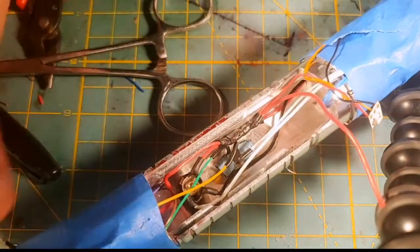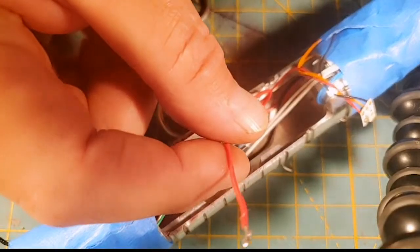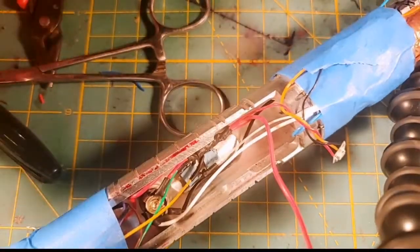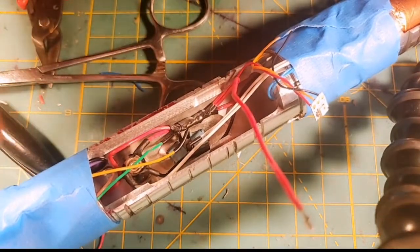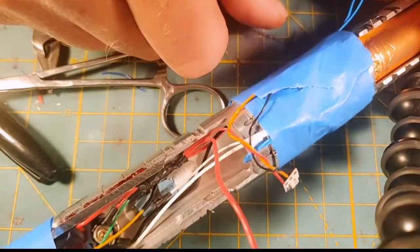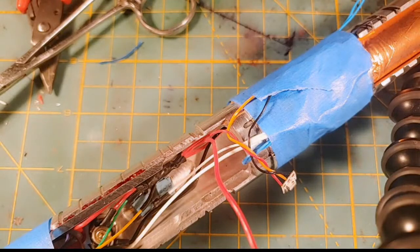Our merge will live down in there, way down below the Proffie board. And the only thing we got going on the Proffie board is this one wire. This one wire feeds everything positive. But the amp load is going to be in this joint for the main blade and for the NeoPixels and everything else. The only thing this feeds is the Proffie board. And remember, the Proffie board is not even half an amp. It doesn't draw anything. It's just not drawing electricity.